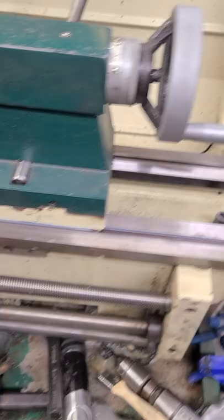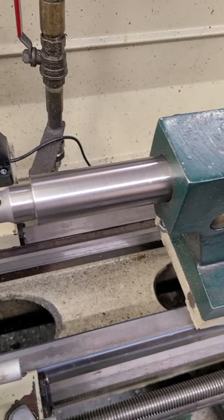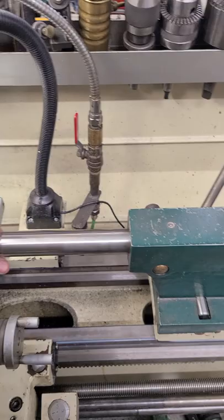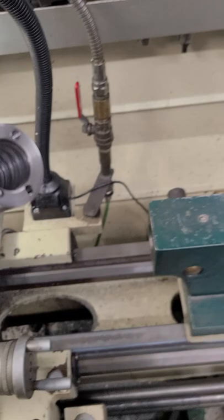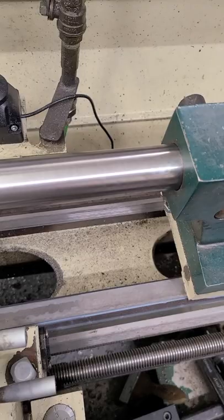So I got some 1045 and made me one. Now it's not — but I just wanted to show something here. I've got this in here because this is like a Morse Taper 3 to Morse Taper 1 extension adapter. I drilled and tapped those, bored it for that little brass piece, slowly snuck up on it. Basically it's 32 mil. You can see how — I'm trying to just one-handed — yeah.